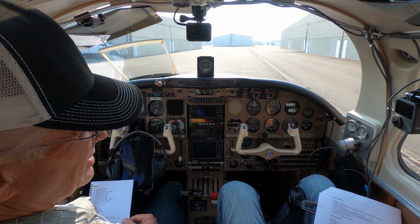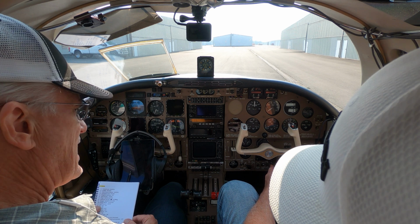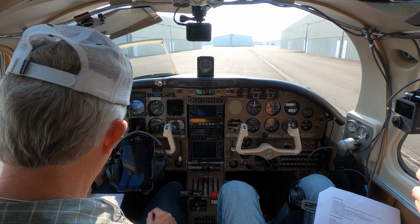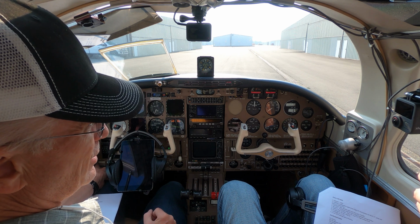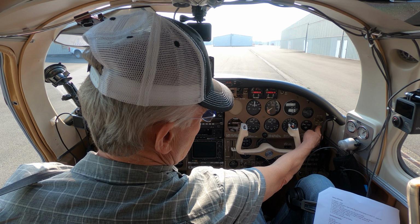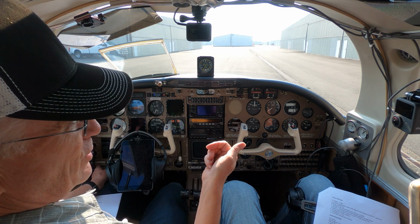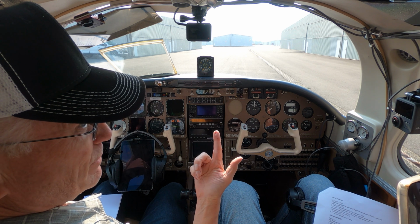Hydraulic pressure is checked, and it is 0 right now. And that will allow me to test the aux hydraulic pump. So if I turn the master on now, I'm going out of order here, I can run the pump, you can hear it running, and pressurize things and bring up the pressure to about 500 pounds. That way when I start the right engine with this off, it'll bring it up the rest of the way. I've just checked both pumps.